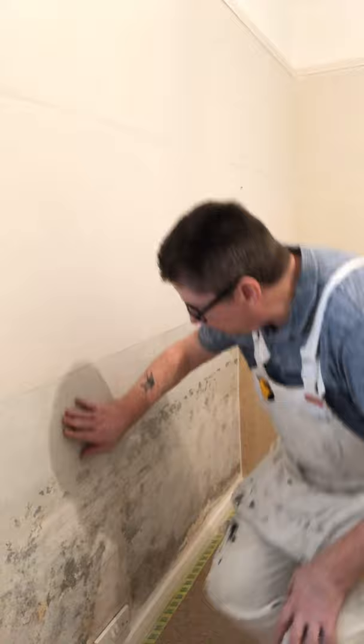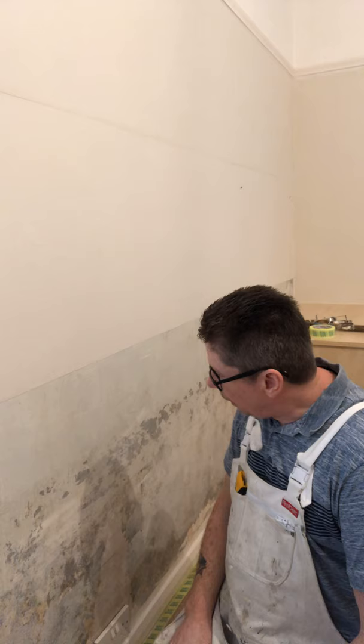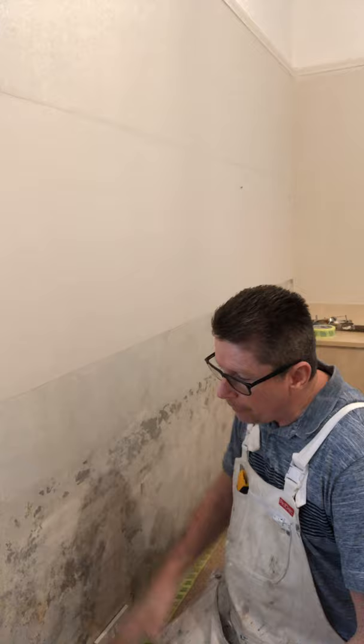If I show you this wall here, you can see I have lining paper already on this wall. When the paper came off, I sanded it all down, gave it a real good sand. There seems to be like a primer or something put on this wall from years ago, but any dry areas, any porous plaster areas — put a coat of paste on before you hang any wallpaper or lining paper. Take your size paste on the wall. If I show you around here at the radiator...